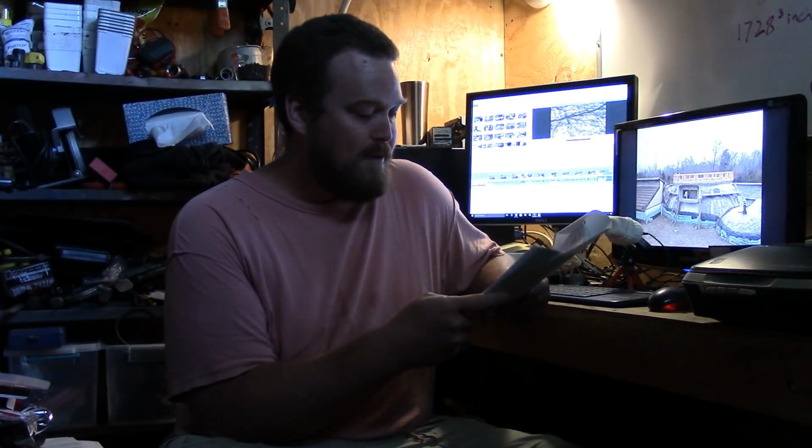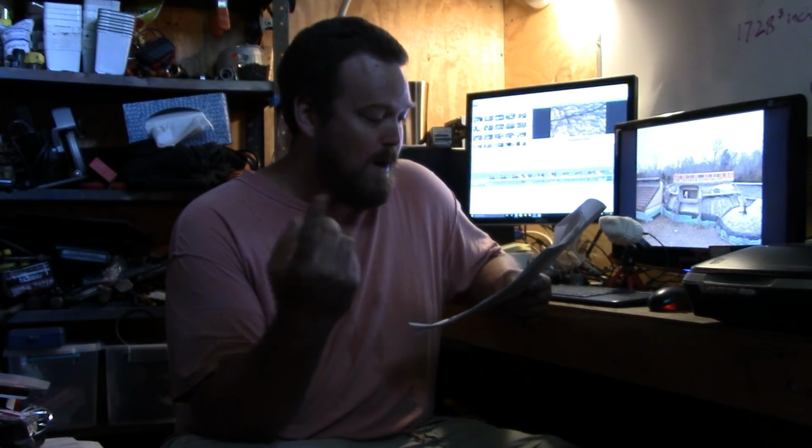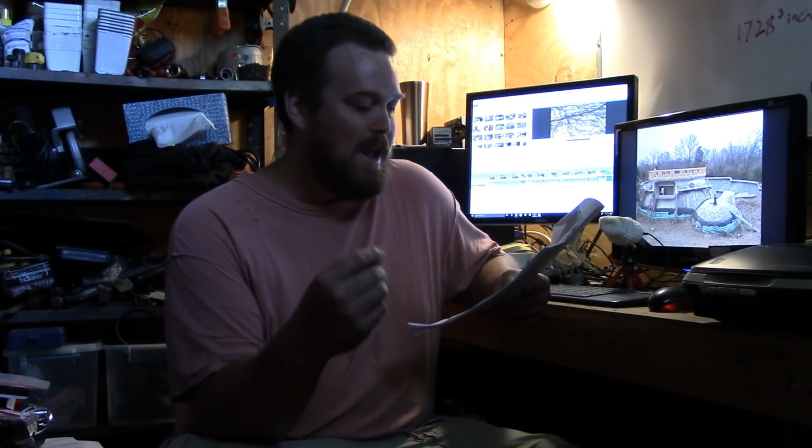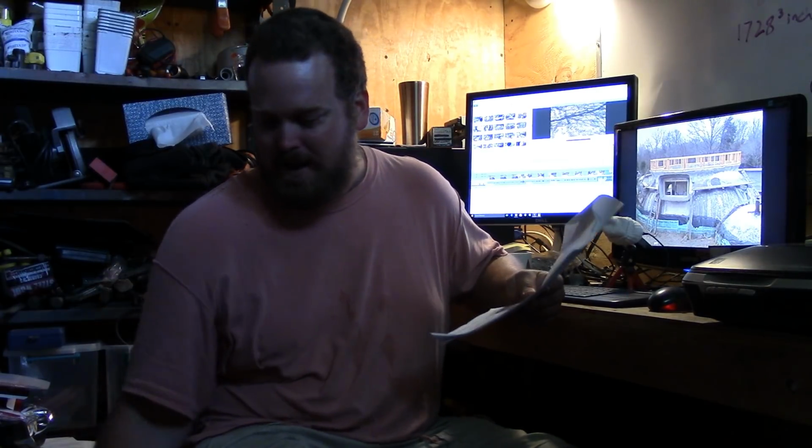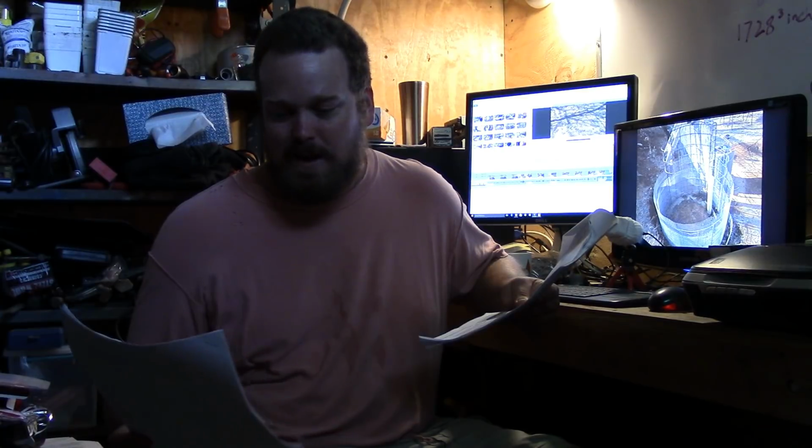Normal weight aggregates should meet the requirements of the ASTM C33 or AASHTO M6 or M80. Those are internationally recognized standards for the material. You know, I downloaded some of them. I think one is like the Highway Department, and another one is some international standards organization. What's interesting about standards is there's not really a set standard for what should be used in ferrocement. You know, the sciences haven't been done. The Ferrocement Society of India, however, is working on ferrocement specific standards. So keep an eye out for them.